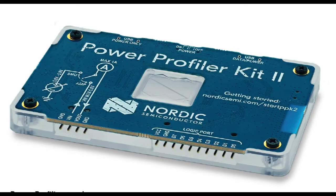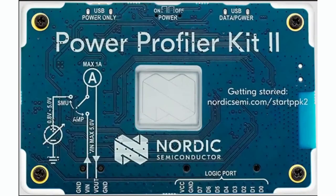All it does is plug in over USB. It has a power switch, a power input-output you can see on the PCB documentation. It has some GPIO, and I think it's even driven by an NRF52840, although I noticed the antenna was not populated. You could always go in and reprogram it if you want. It has all the analog section you need. You can see the antenna section to the right — it's not Bluetooth, it does it over USB data. It shows up as a serial port.